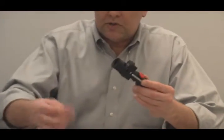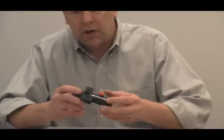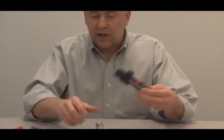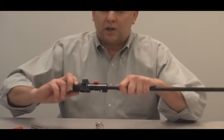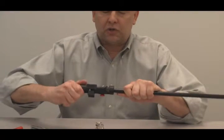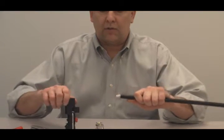The cable is kept nice and round. Now flip the tool — that pellet will just eject. Flip to side two, and right now it's already set for clamp. You can loosen or lock that thumb wheel, but just make sure in the case of this connector that it's set for clamp. Place it over the cable.